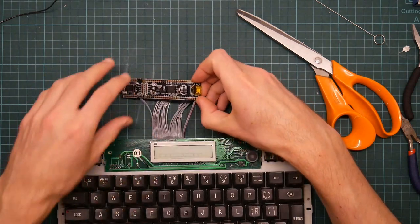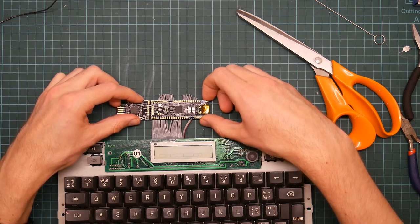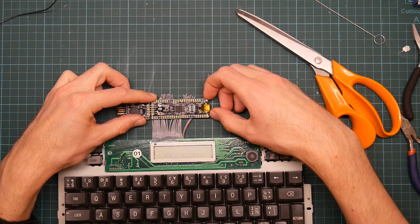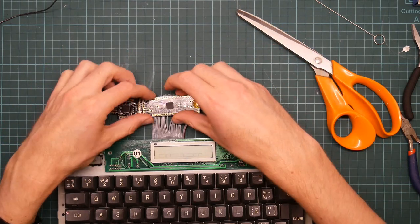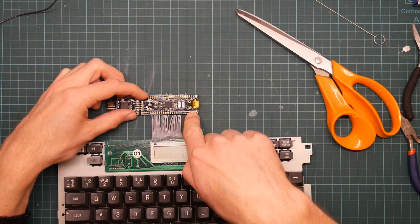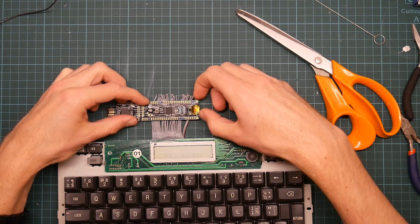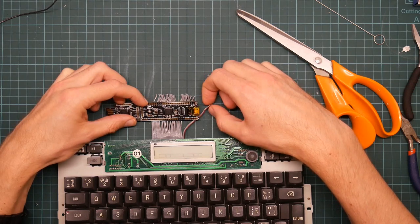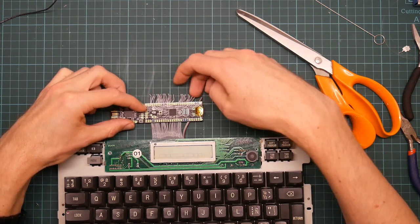Okay, so we're going to put this about here. The cables need to splay out, so we need to give lots of slack. So actually, let's assume that they're going in at the end. Interesting, actually. I was planning on soldering this row first, trimming the wires to length, soldering these, and then doing the other side. So I'm now rather wondering whether I want to do it the other way round, because there's actually going to be more splay than I thought.